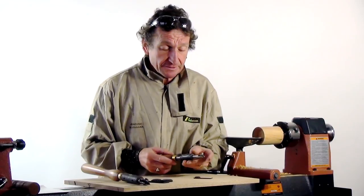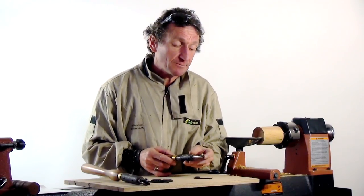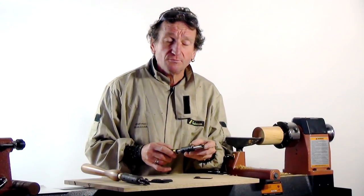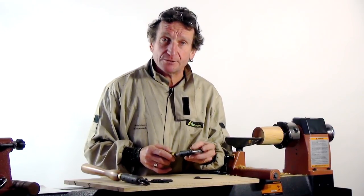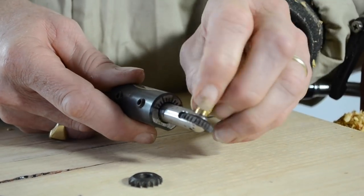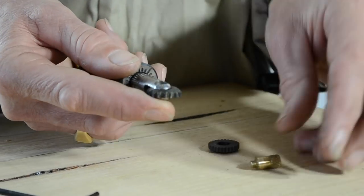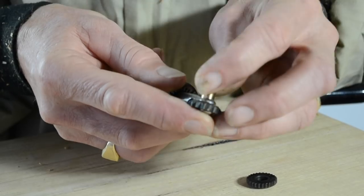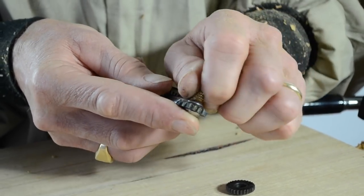The smaller tool consists of a smaller wheel. There are two in the kit — one that's 17 TPI and the other one is 27 TPI. The finer the teeth, or the more teeth that there are on the cutter, the finer the pattern it will produce. In this particular case you've got this knurling knob that you release, and you simply place the cutter inside the tool and tighten that up.